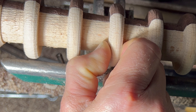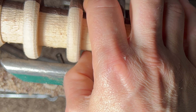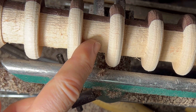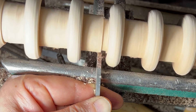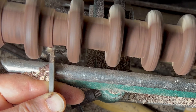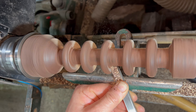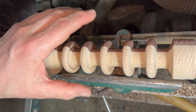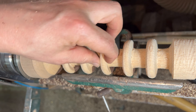In order to make that round and get the skew chisel in there as deep as I can, I'm going to have to come a little bit deeper on the stem to allow room to get my skew chisel in, because I do want these rings round. Before I go too deep on those sides, I'm going to sand as much of it as I can to get as round as possible, and a little bit of shaping with the skew chisel.